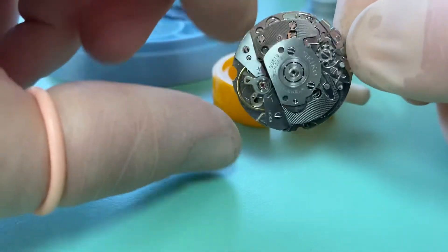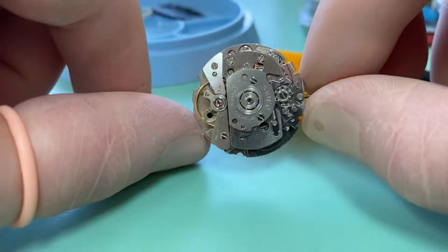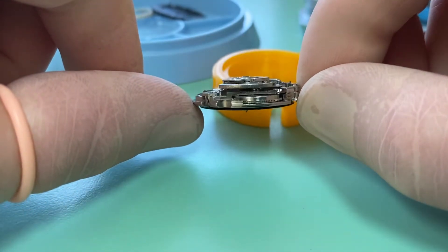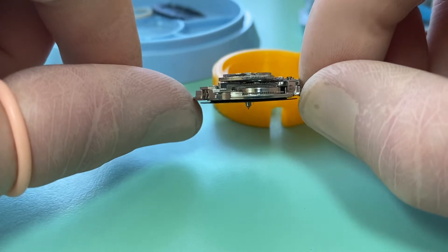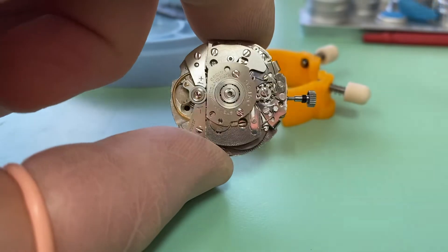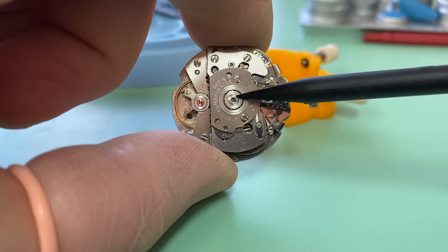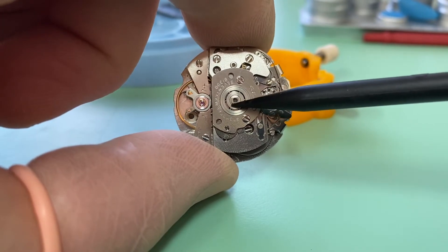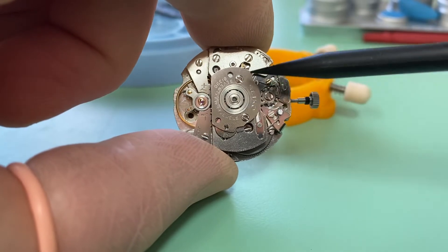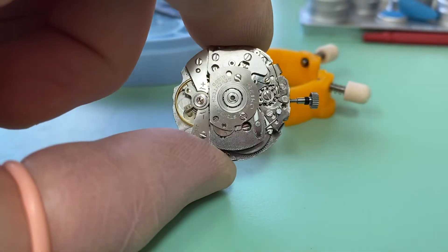Some other issues that come up with the 6139: we can see that this one's been serviced — it's looking nice and shiny. It was pretty filthy when it came in, but after its bath in the ultrasonic tank and overhaul, it's looking quite good now. Sometimes the bearings can get sloppy for the oscillating weight. These are the bearings here. Usually when these bearings get sloppy they need to be replaced, but I've actually come up with a method to tighten these bearings up, saving cost to the customer and getting further extended life out of the watch.